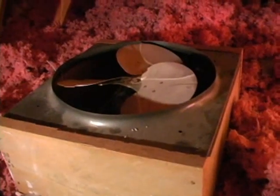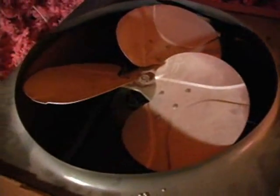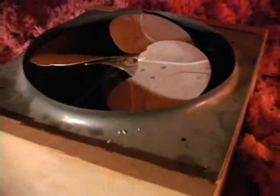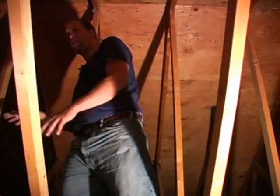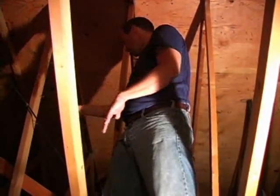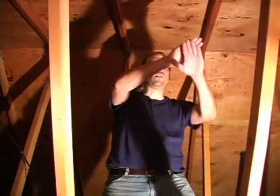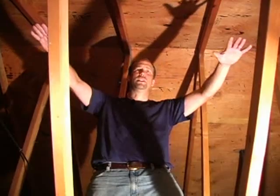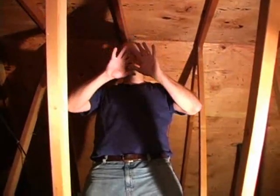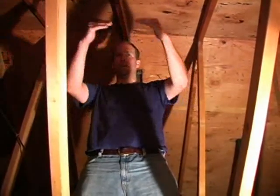And we have other areas where the insulation is missing. The whole house fan is not insulated with a cap. So in the wintertime, this really is just a large hole for energy loss. There are areas where electrical lines and phone lines have been installed, and the insulation has been removed but not put back. So I see that wall back there, and I see over there and there and there, all along that area where we saw in those bedroom ceilings, hot areas, there's actually missing insulation. The insulation has either been blown away because of the high winds in Colorado, and there aren't any baffles, or something else is going on there.